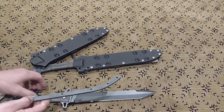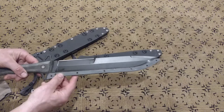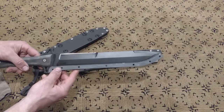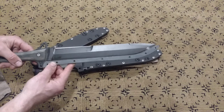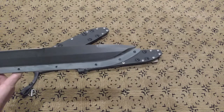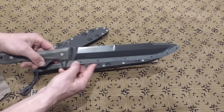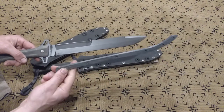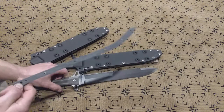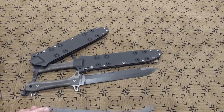The spacer that goes on the edge side of the knife looks like this, and you can see that you have an air gap between the knife edge and the spacer — except up at the point. The point contacts, and then down here by the choil it contacts, and everything in between is relieved so that you don't have your knife edge resting on this ABS plastic all the time, which probably wouldn't make it dull anyway, but no sense in touching something if you don't have to.